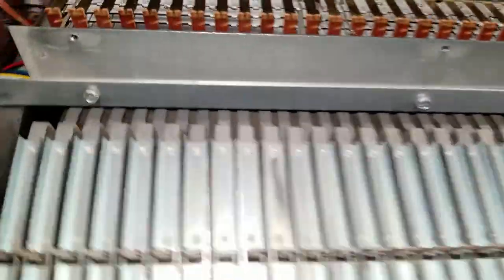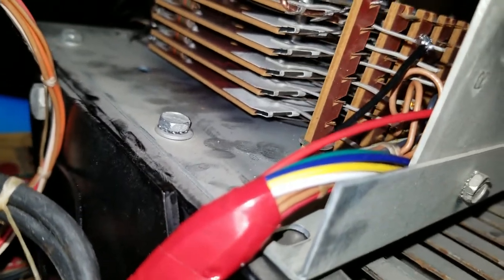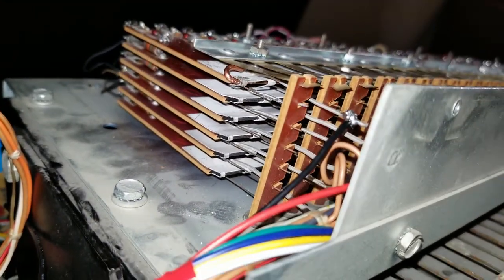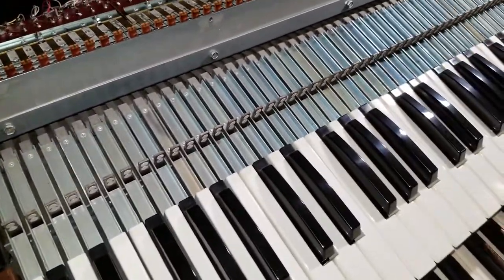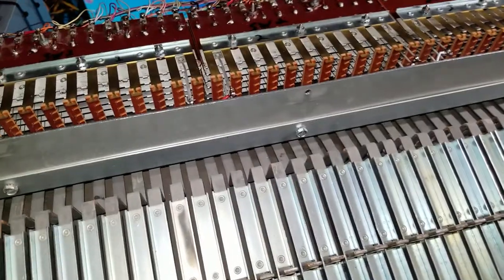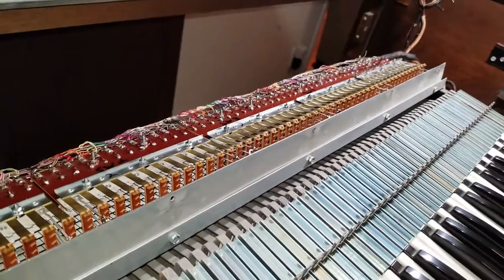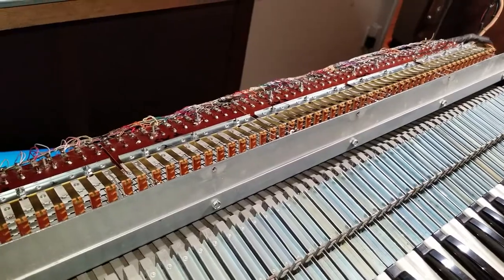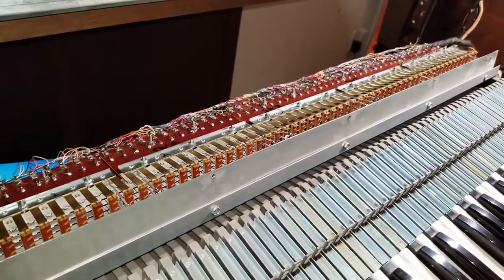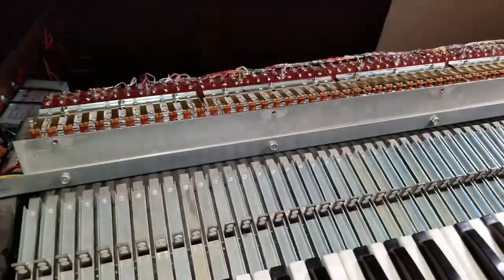You can kind of see that here — when I press a note, you can see all of them are gently scraping. You can even see on the copper that it's shinier where the gold wire comes into contact with it. If it ever gets too bad, you can just slide out the copper wire and put a new one in. Same with the silver — or you can just clean it.